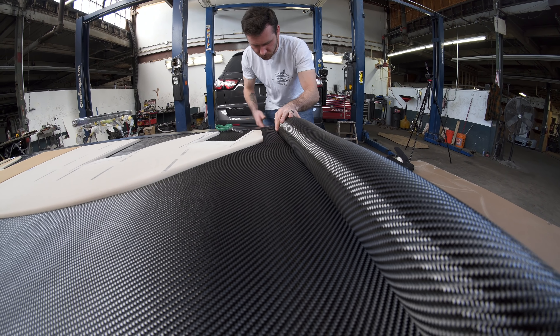I'm switching off between turning the vacuum on, moving it a little bit over, sucking that down, holding it, turning it back off, moving it a little bit this way — basically pulling all the material so it'll be flat here and conform to all the curves without having a pocket between it. It works pretty well, it just takes a little bit of time. I'm using the back end of a spreader because it's soft and not going to cut the bag, but it's firm enough on the edge that I can get good pressure in it.